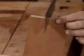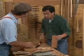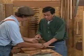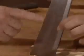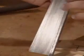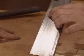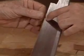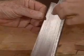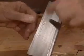Actually, the Ryoba is a little bit of a production saw, but this is a very, very fine handmade saw. You can see in them the tensioning marks on the blade, where it's been struck with a hammer to tension it so it will lie straight. And on each tooth, you can see the tiny little strike marks from the person who sharpened it, setting the teeth. And you can see it's on every other one on the other side.